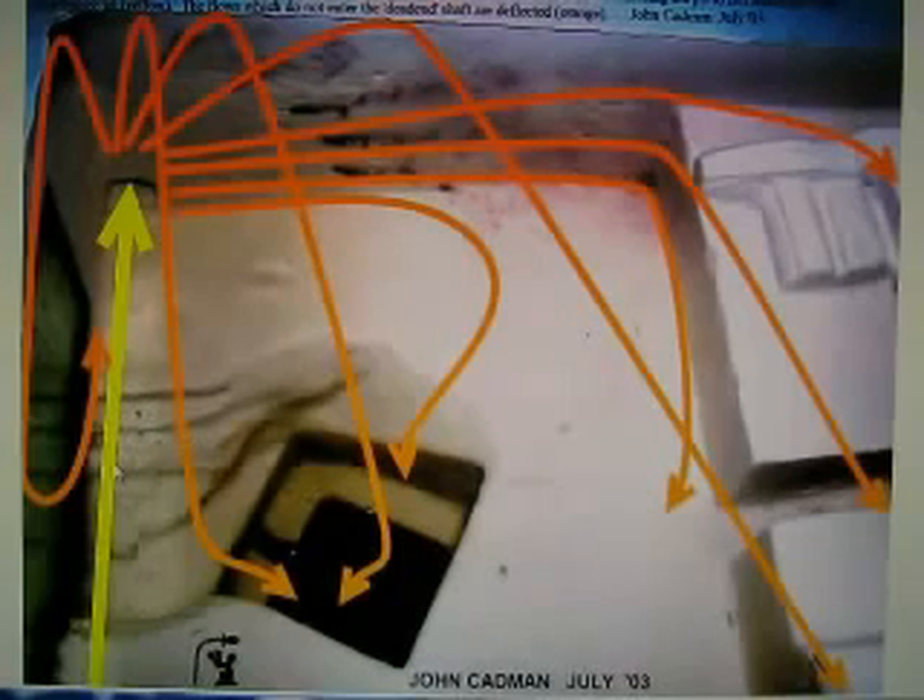It's actually ink — this is how I determined it. This ink from the entrance room goes across. It shows it going down on the floor at this level, dropping into the pit, and then going across, hitting the step face, and then being redirected by this channel. So that explains the channel — it redirects the fluid flow. This is overhead. You can see a fluid jet going in — it's lighter in this area because there's no ink there. There are ink jets here, here, here, and here — that's exactly how it was determined where these go. You have a lower level that comes across, hits the face, and curls. You have a mid-flow, and an upper flow that uses the ceiling — goes across the room, drops down to the pit. One goes to the ceiling, encircles, and actually presses down, lowering the overall level of the jet. True genius.